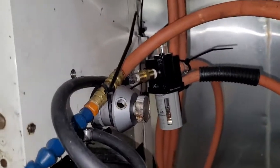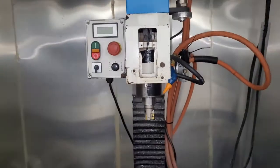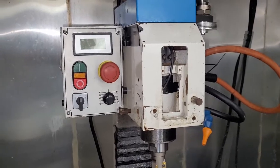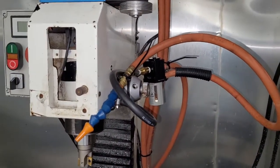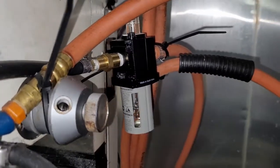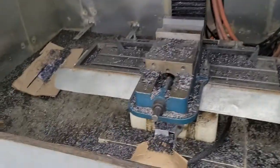Our oiling system still isn't finished — it's manual right now, but it works. This thing hanging on zip ties, we're going to build brackets and bolt it up. To finish the oiling system, there's like two or three other little issues. I've got the electronics installed, but I need to add a diode to one thing, and the fittings I bought were wrong — I got the new fittings, I just need to hook them up. So we're probably looking at maybe an hour before the oiling system will be completely automatic, which means less of my time — I don't have to oil bearings, the machine takes care of it. The only thing I'll have to do is make sure there's oil in this — maybe every five or ten parts, just top it up. One of the nice things about having an oversized enclosure is I can make a lot of parts before I actually have to clean out the chips.